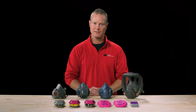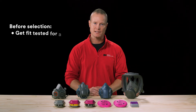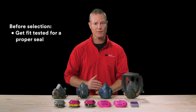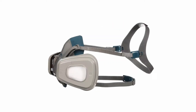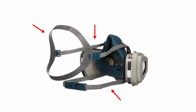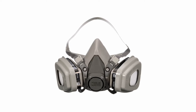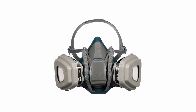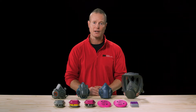To ensure its effectiveness, your respirator must fit properly. Before selection, you will want to get fit tested to confirm the respirator seals to your face and is comfortable to wear. One of the benefits of reusable respirators is their adaptability. The head straps, head cradle, and neck straps offer various adjustments that help ensure proper seal and a comfortable fit. Reusable respirator face pieces come in a variety of materials such as thermoplastic elastomer or silicone. The material can impact the comfort and durability of the product over time, depending on your working environment.